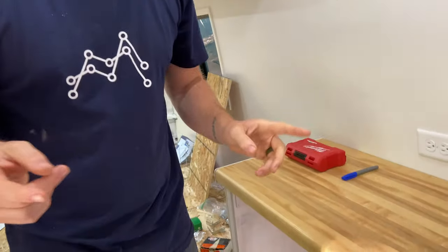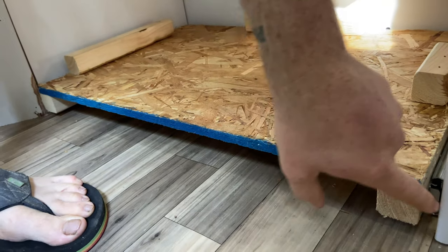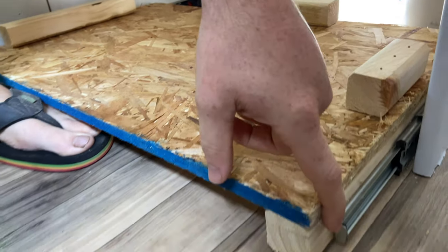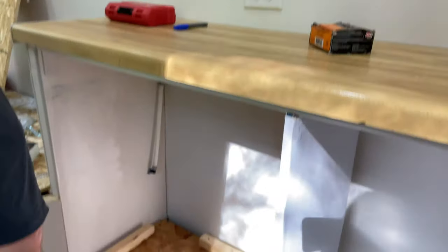So the much easier solution, which means you don't have to cut your shelf to the exact right dimensions, it can be kind of close, is just to put two by twos on the ends here, and then you build your shelf on top of that. You attach your hinges directly to the 2x2s, which are much stronger material to screw into. And then you just put your shelf on top of that. You don't have to measure this part to be exact. Your 2x2s can just be floating in midair, and they'll support the weight correctly. So I think that works great.